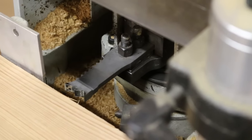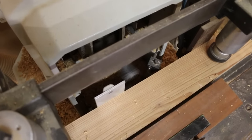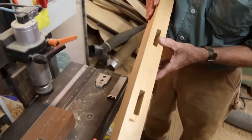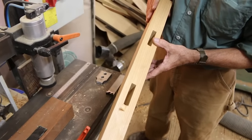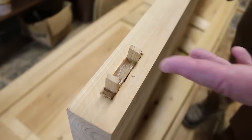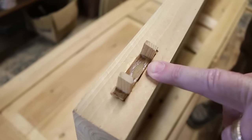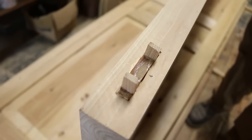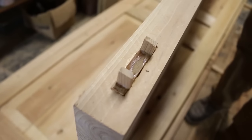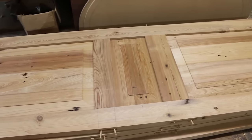If you've got eight doors, that's 64 mortises you can do in less than an hour. You have a through mortise and you actually wedge them — we cut that tenon and then drive two glued wedges in there and it keeps the pressure. You can immediately take the clamps off, lay the door down, stack it level, and move on to the next one.